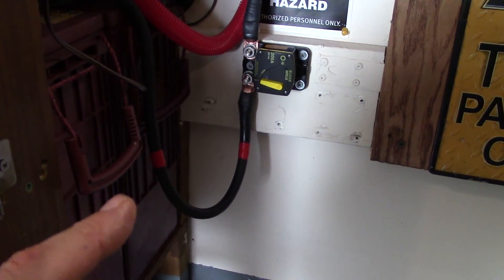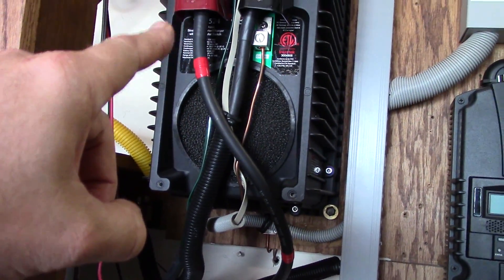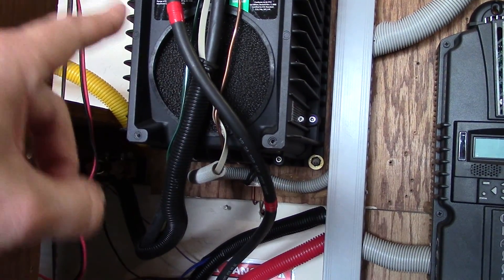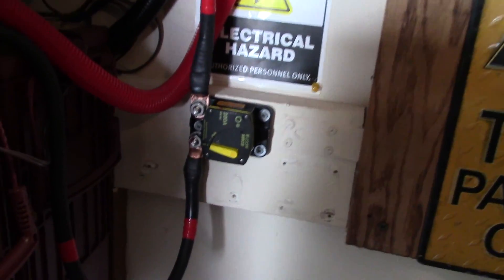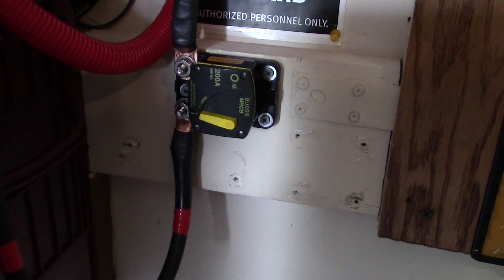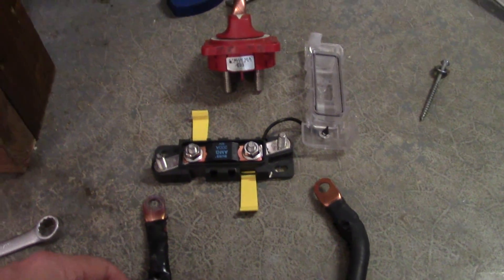Here's what I'm concerned about — I have the Outback Power VFX 3524 here. Power goes both ways: it charges this way, like right now I'm charging, and when it's inverting it pulls power off the batteries. So the circuit breaker has to work both ways. Right now I'm charging and it's holding, so good on that. Let's get to the really nasty bad stuff and I'll show you what happened.